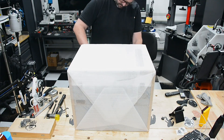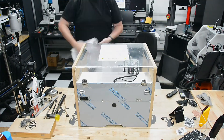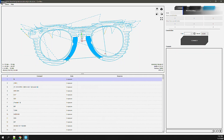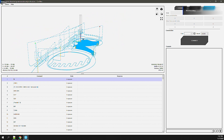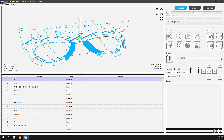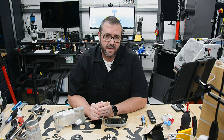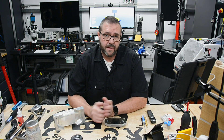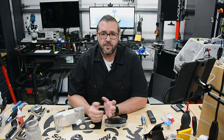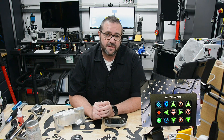The machine came well packaged and organized. In addition to the physical product, they also offer a simple CNC software application you can download from their website called Cremove — a slightly customized and branded version of the open-source CNC software named Candle. Since the machine leverages GRBL 1.1, you can use any CNC software you prefer, like Candle, Universal G-Code Sender, or CNCJS. If you want to leverage a Stream Deck pendant, you'll want to make sure your software has the hotkeys needed to support it.